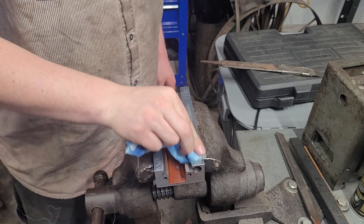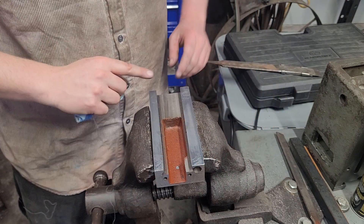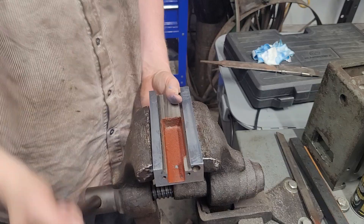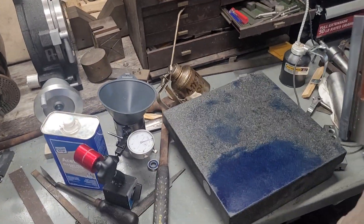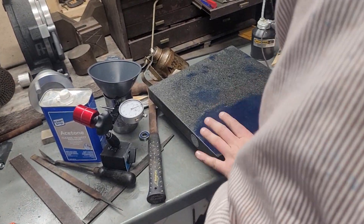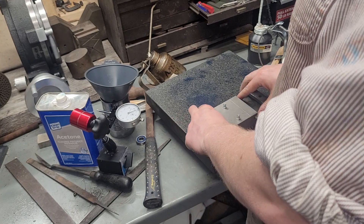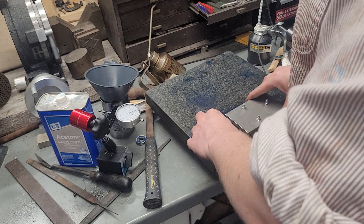When I hit this on the surface plate, I just run my finger over it and feel for any burrs. This is cast iron, so it doesn't really burr — it kind of just fragments, which is great. It makes life easier because you aren't forced to stone between every single application. Over here is my surface plate, which is a flat reference surface — flat to a couple tenths over the surface.